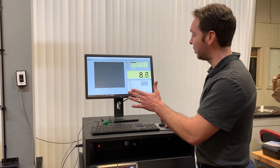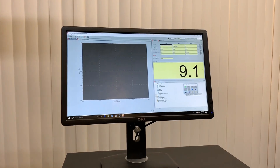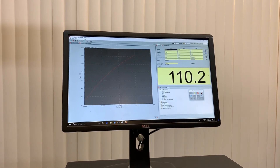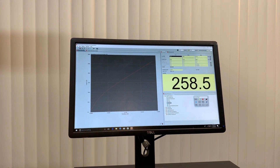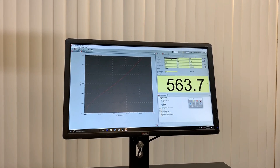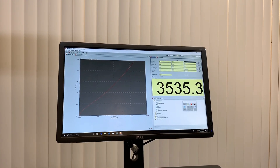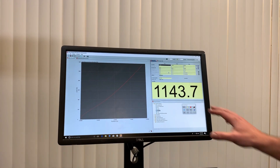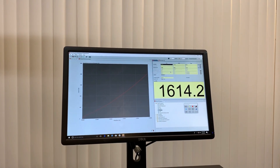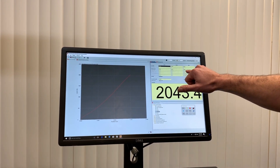I have everything preset in the procedure. I'm using a tension test with no extensometer, just to give you a simple peak load and extension type test. Hit the start button and it begins recording. As you can see, we're getting a nice load versus displacement graph as the specimen is being pulled. I have the live channel of load selected, which displays up here — I can show position, peak, live, or rate. Right now control is from position, so we've designated that we're moving at a certain speed, and it's showing us live load results. The machine is programmed for 0.2 inches per minute.